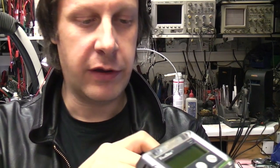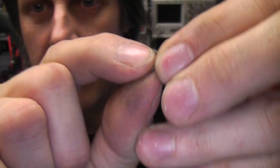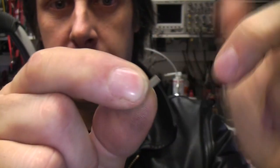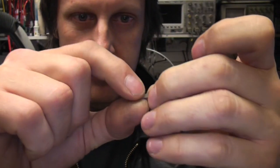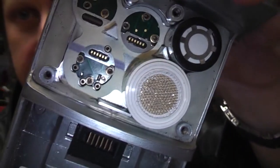The way these sensors connect — there are actually pads on the PCB and in between there's a little elastomeric connector. These are very similar to the connectors they use on certain types of LCD. Basically it's a rubber-like material with metallic strips, so it's conductive in one direction but not the other because they're individual strips. When it's compressed it means you get good contact, and the rubber provides the spring you need to maintain a connection. Those just go down onto the sets of pads on the PCB.